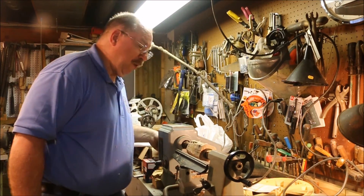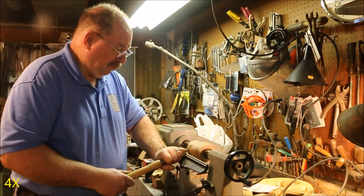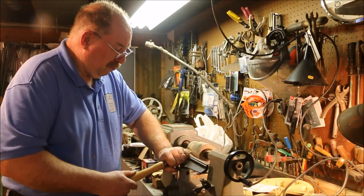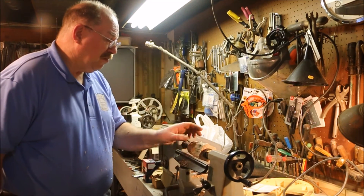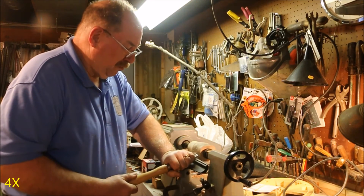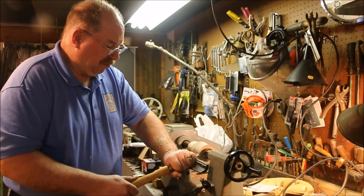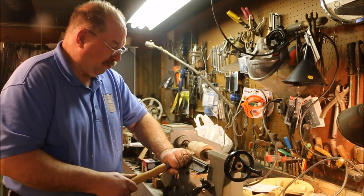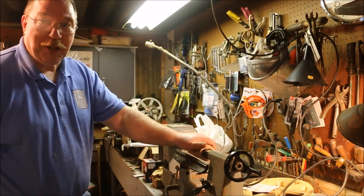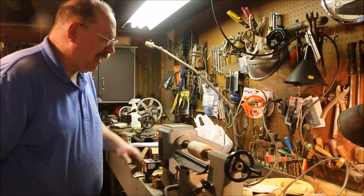I got a big old wormhole alongside. Another quarter inch before it comes out round. It's a real temptation to reach out and grab a hold of that spinning thing just to feel if it's round — well, that's a great way to get a sliver in your finger. Hold back on that temptation, don't follow it.